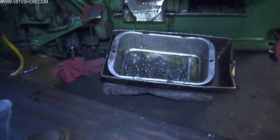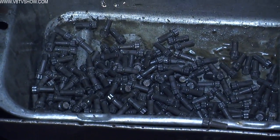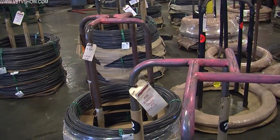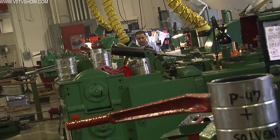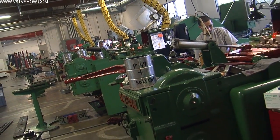This room is where the very beginning of formation happens — you take the raw coil and it starts to form the fastener or stub. The coils are different colors, sizes, and textures because each machine handles a different size. The main difference between machines is size: quarter inch, five sixteenths, three eighths, seven sixteenths, half inch, and five eighths cold formers. Different wire sizes are used for different bolts.